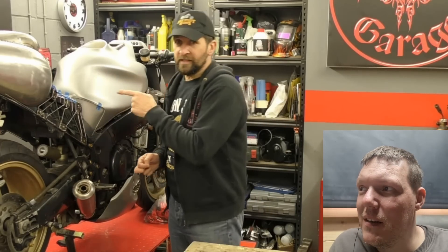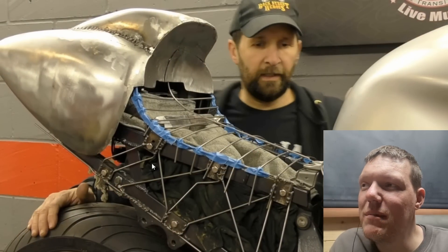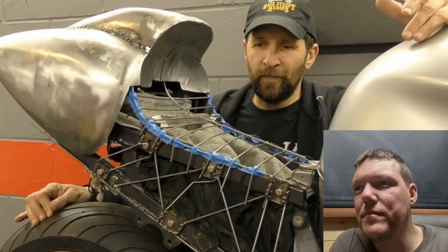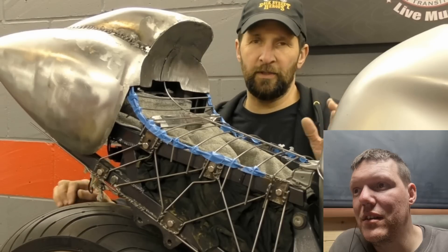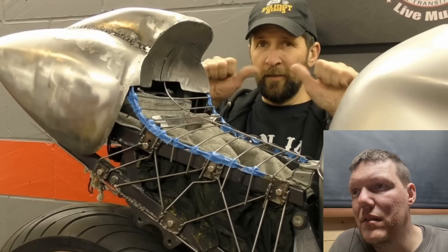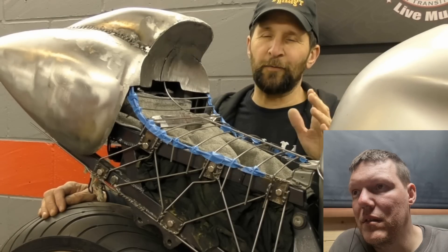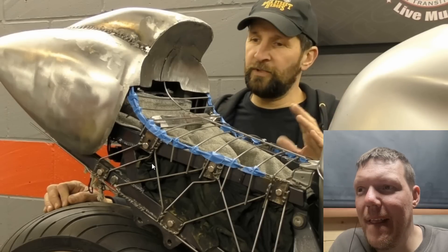Right, let's shut up about that. I'm going to show you what I did in the meantime on this with the wire. I hate to do this without you, I really do, but I had to get this rather long-winded process done. It was better to do it and then talk to you about it now. Bending these wires - you've got to put them in the vice and get the bend right. This mild steel wire is extremely useful for this job but it's quite soft and you have to treat it right. It took about two and a half hours.